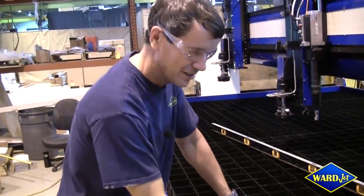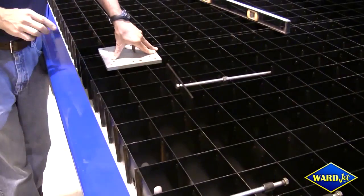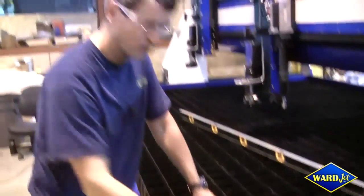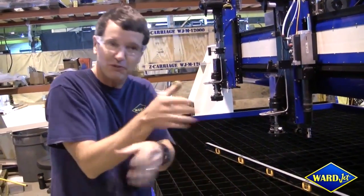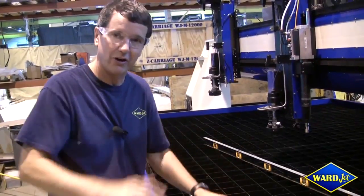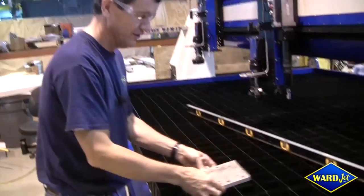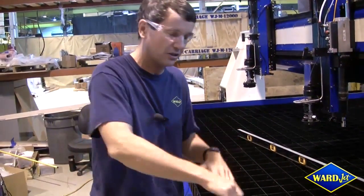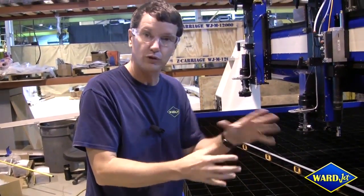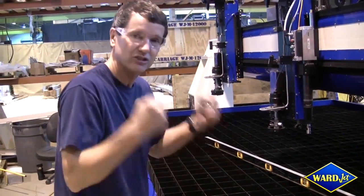motivation behind this style of grate, where we have very thin supports. You won't find these anywhere else because, of course, unless they are welded into a structure like this, they are floppy and they're difficult to support, and your material will shake all over the place. As soon as you have slats, you put your material on the slat, but of course your slats can shake. Go to anybody's machine which has slats, grab them and shake them, and you'll find they move. Well, you might have a fantastic tank and you fail right at the very end because you can't clamp your material down and have it solid.